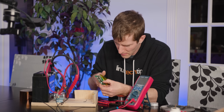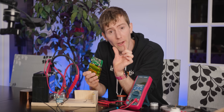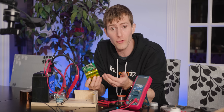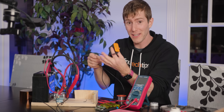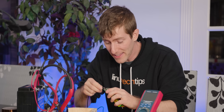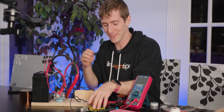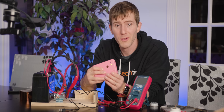We've got 7.2 volts and I press the button — it just came alive. You know what it probably was? It's only got one bar, so it's actually a very narrow voltage range that most of these types of batteries operate within. We were probably at the threshold where the thing won't turn on at all. I had planned to bring out a charger as my last resort — it might've just been so dead that the battery indicator wouldn't even work. So let's plug this in. It's charging. We did it! Reassembly time. We glue it shut and there it is, working as intended.